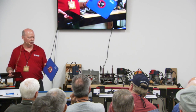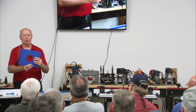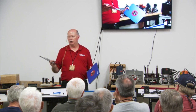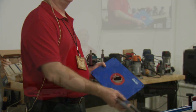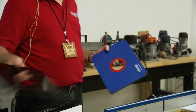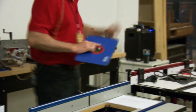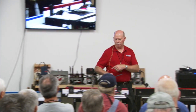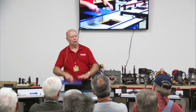With plates, there are two different size standards in the routing world. Both are 11 and 3/4 inches long. The difference is that most are 9 and 1/4 inches wide, while Rockler and Bench Dog plates are always 8 and 1/4 inches wide — they're not compatible with each other's systems. If you buy a Kreg table with a Rockler insert, it'll fit but leave an inch of open space and the levelers won't align. Kreg, Jessem, Woodpeckers, and most others use the standard 9-1/4 by 11-3/4 size and are interchangeable — I can take a Woodpeckers lift and put it in a Kreg table, or move them around between Kreg and Jessem.